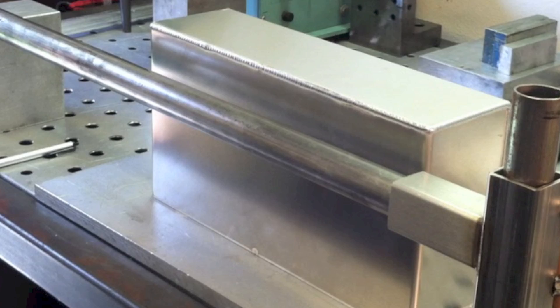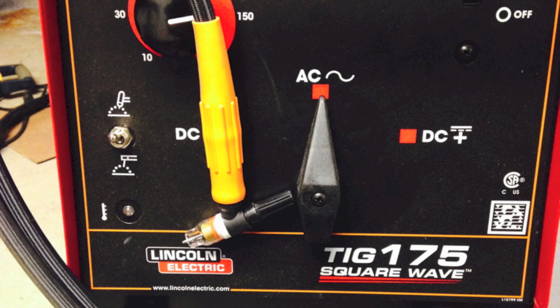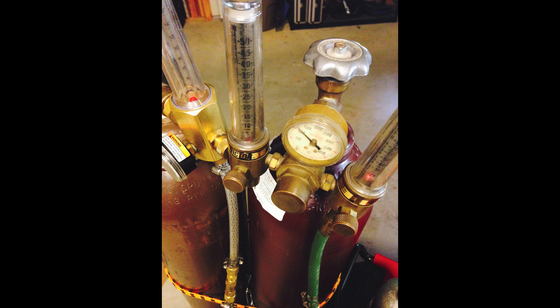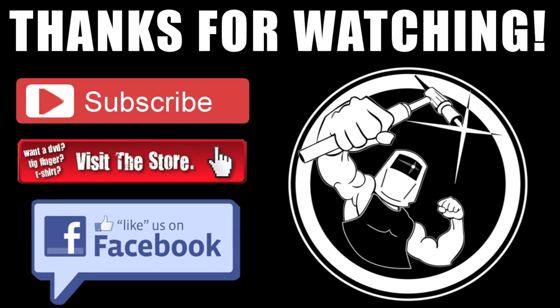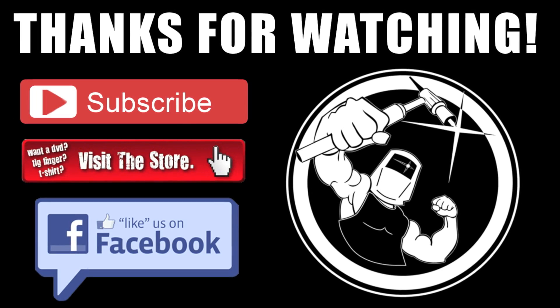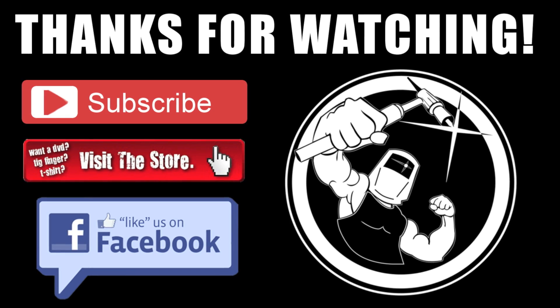That about wraps it up — here are some of the final welds Roy did. Nice job, Roy. For the arc shots I used a simple Lincoln TIG 175 with the stubby torch from WeldTech, a pyrex cup, and a little bit of helium. I used about 10 CFH of argon and just barely cracked the ball on the helium, and it cleaned up the puddle quite a bit. Thanks for watching — hit the subscribe button if you like this kind of content and visit the store at weldmonger.com.